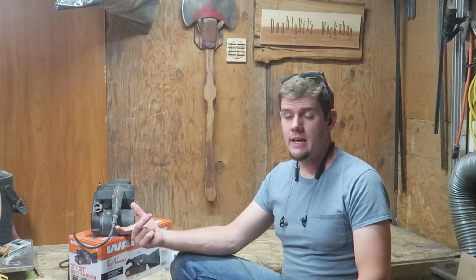So a lot of tools, and I know a few of you out there will know this as well, had just 3-inch pigtails. It was the most annoying thing in the world, because if you didn't have an extension cable readily available right there when you grabbed the tool, you weren't thinking because it was a long day at work or something else was going on, or hey, you're gonna go over to a friend's house and he just so happens to have no extension cables that are 3-prong. So you're trying to find some way to cobble together, and a lot of construction grade tools are just normal tools that even using 120 volt need a thicker gauge in order to properly send the current for the tool to even turn on. Otherwise, a lot of times it'll even damage the tool, so you can't even use like a cheater on a 2-prong extension cable to make it work. So there's a few times it's like, hang on, I'm gonna drive home, grab an extension cable, and drive back.